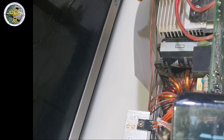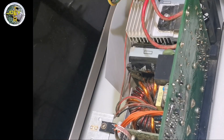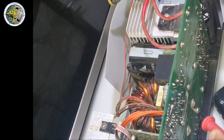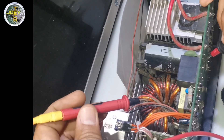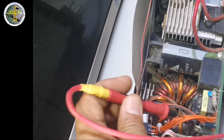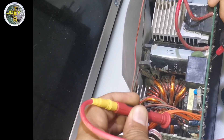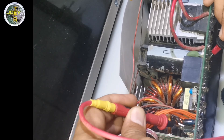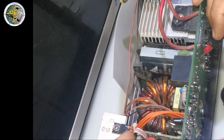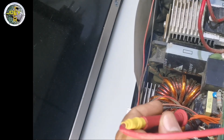Please be careful when handling this type of inverter welding machine, especially when voltage checking. The negative side of the main filter capacitor at 300 volts is also connected to the negative side of the 24-volt filter capacitor. Let's check the continuity from the negative of the main filter capacitor to pin 2 or ground of the LM7815. Continuous beeping means a connection between the two points. Please be careful when troubleshooting — to prevent electrical shock, you must isolate yourself from earth ground.